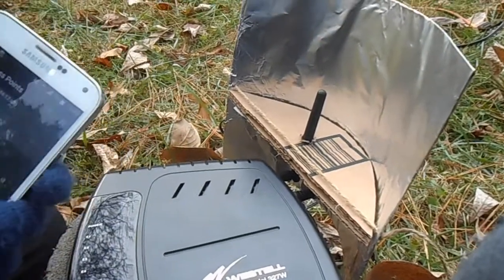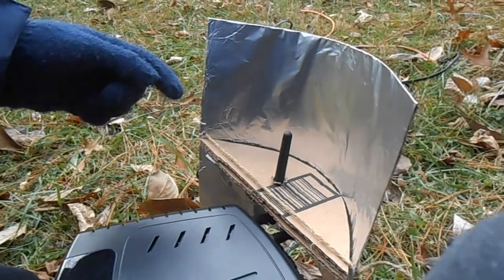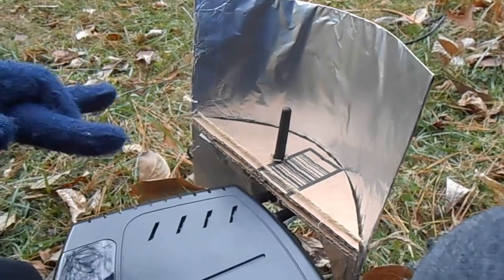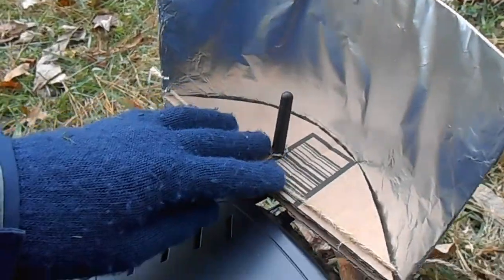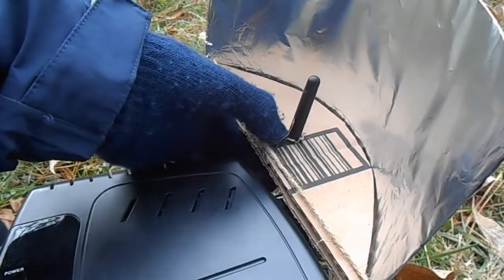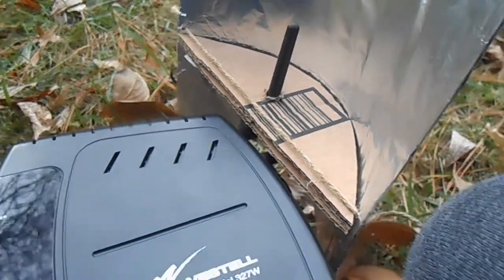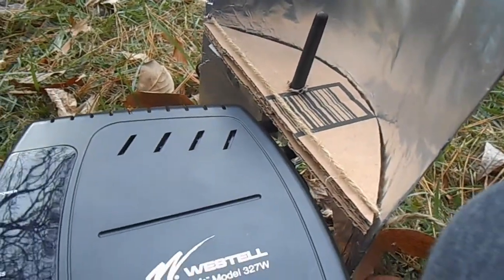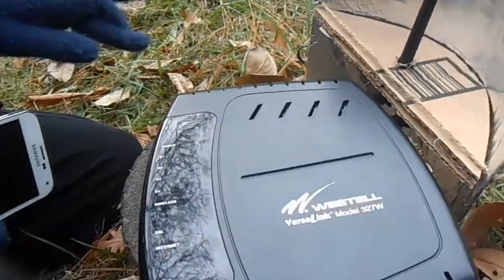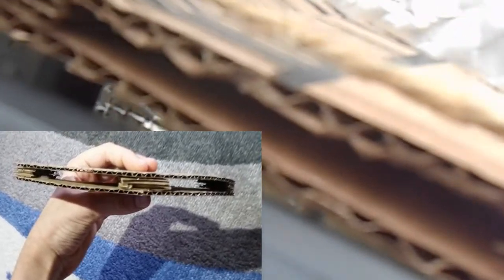So can you tell us how it's made? Yeah. The way we made the parabolic reflector is you can take some thin cardstock or something you can bend, and then you put aluminum foil on it, which reflects Wi-Fi pretty well, or a lot of signals. You also want some thick cardboard, and you want to cut it up and put spacers in between, so if you can see in there, there are two levels of spacers.